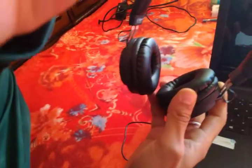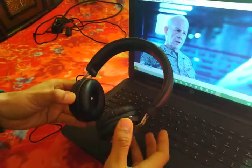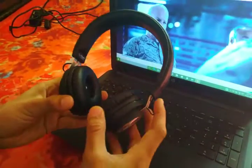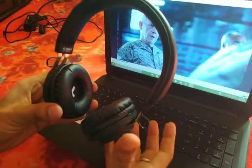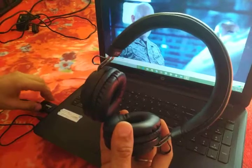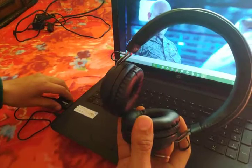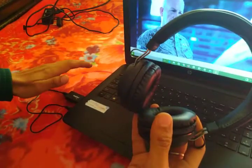I can't let you hear it, but a humming sound is coming when I apply these headphones on my ear. So how to remove this humming sound? The humming sound comes when you supply the power from the same source from where you are transmitting the audio — it creates some noise. The best way to remove this sound is to remove the power supply from there.